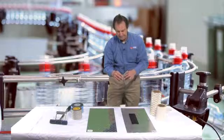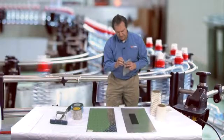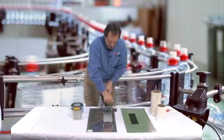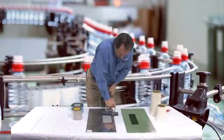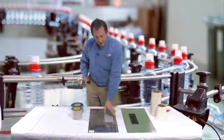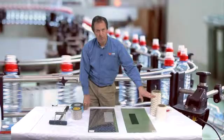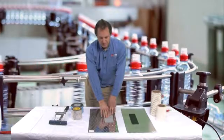On this diamond plate, I've got some 3M VHB tape on this particular product, and we're actually going to press this down onto the diamond plate. Now, keep in mind that when you're dealing with acrylic adhesives versus rubber adhesives — the rubber adhesives are going to max out their bond strength immediately upon first contact. The acrylic adhesives do provide a very, very good secure bond onto this diamond plate, but VHB tapes actually have a 72-hour cure. Most of the acrylic adhesives are going to have a 24-hour cure. VHBs, being as thick as they are, won't completely max out their bond for 72 hours.